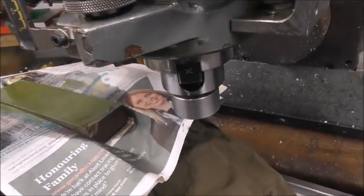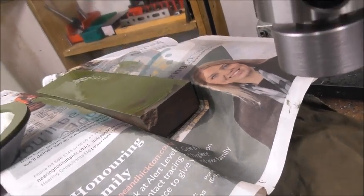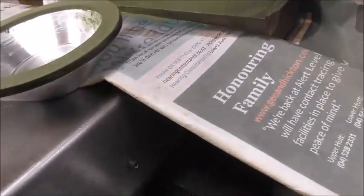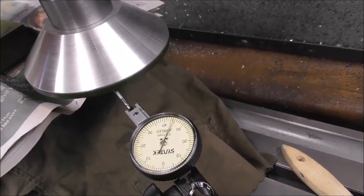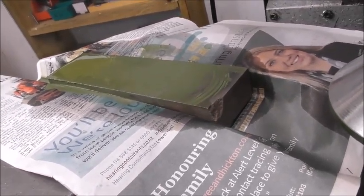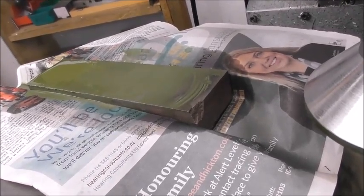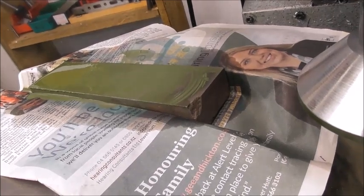Going through some of the details: I'm running the spindle as slow as I can — about 70 RPM. I'm using a woodworking stone, a bi-grit stone with one fine side and one coarse or medium side, with the medium or coarse side to the top. I'm using a diamond wheel of about 150 grit. Now let's try it on another grinding wheel. This grinding wheel is 320 grit — the one I measured before — with a run-out of about 5 hundredths, about 2 thou. This is a coarse wood tool sharpening stone, probably around 100 to 300 grit on the grey side. The fine side is sort of a rose colour, maybe 500 to 700 grit. We'll leave the coarser side uppermost and try it.